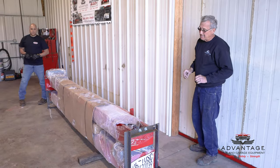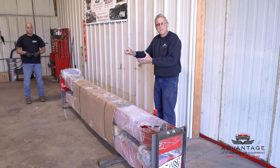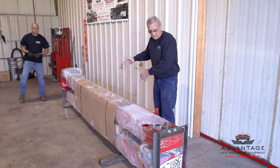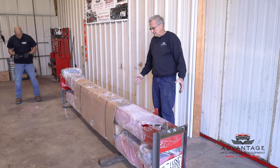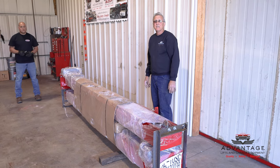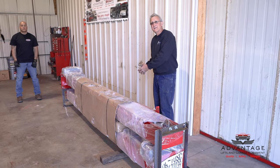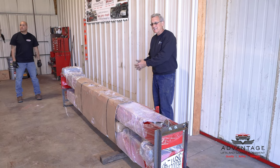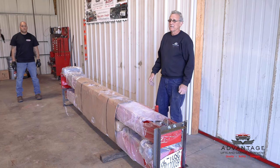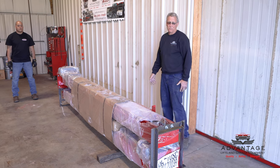If you suspect anything, just tell your driver, I want to put down on my receipt possible damage until further inspection, because he's not going to want you to unpack this whole thing. But if you see something questionable and you look, they'll mark that down. They'll write that on your receipt. And once you sign that, now you have an out that if there is any further damage that you didn't see at first, then you can go back to the trucking company, and they'll take care of it. Okay, so it's important. Inspect your lift before you sign for it.